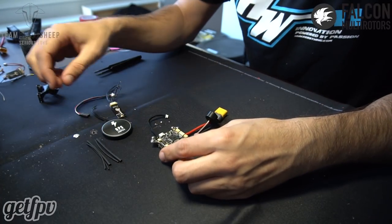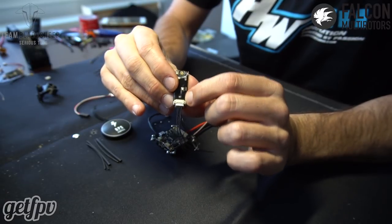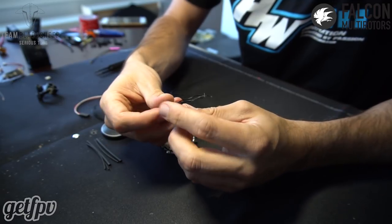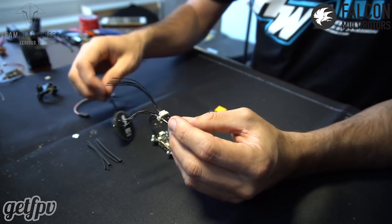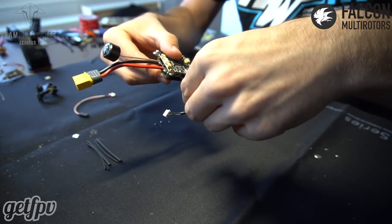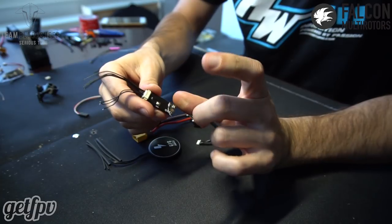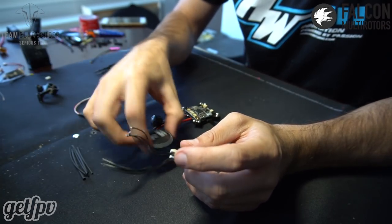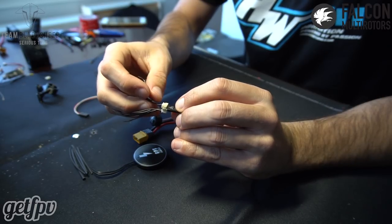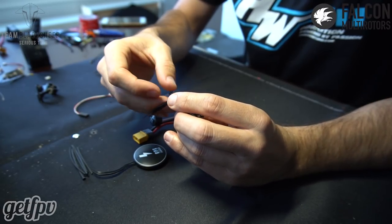We're going to need to make a BST harness. On the back of the Crossfire you have your BST plug — a lot of people might wonder what that's for when running Crossfire on a quad. We need to make a harness from the Crossfire to the GPS, and then into the flight controller. That's going to allow us to control the FPV Vision — TBS's OSD — with the Crossfire, do all the configurations, and have the GPS working. For the Crossfire we only need ground, 5-volt, and channel 1. We're not using Betaflight OSD; we're using TBS FPV Vision, so just these three wires.